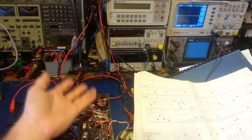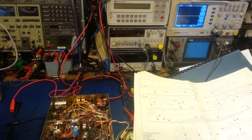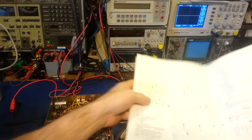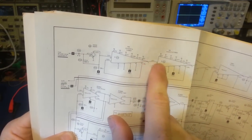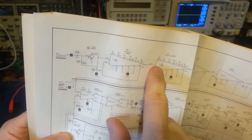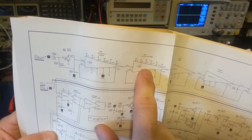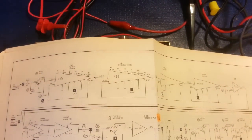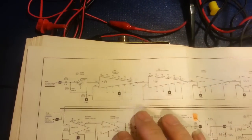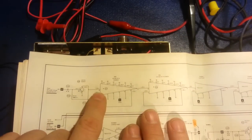Especially with a brand new radio, you want to move it around as little as possible. The signal comes in here, comes out, and it's just on the bottom side of the board as a circuit trace connecting to the next divide-by-eight counter IC and out from there. In the Sam's manual, this schematic is actually a little confusing — I actually had a calculator out earlier. It's pretty bad when you have to get your calculator out to work on a radio.